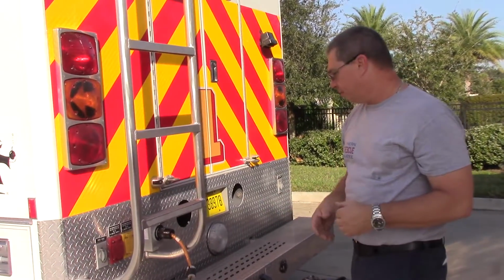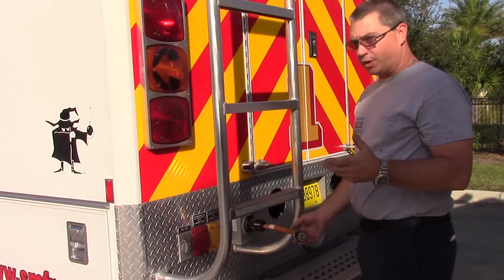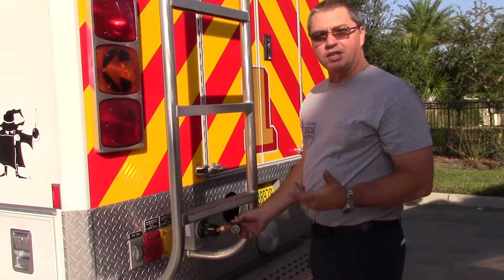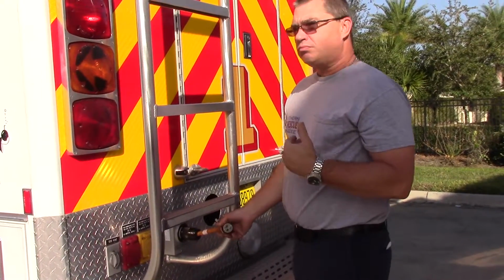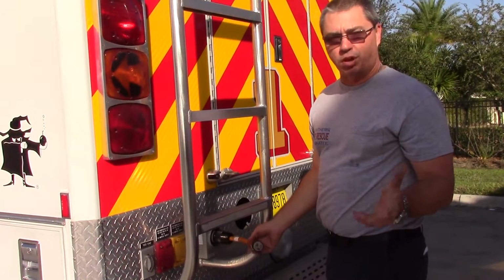Next step, we have a non-incident power up, say like open house in the station at the bay at station 1, is shore power. Shore power can either be done by the drop cord in the bay itself, that's been specially put in, it's a 30 amp cord, or if you need just basic lights, maybe an AC and you have an extension cord, you can plug this into the truck from shore power. Unlimited use and time, but you are limited to the power that you have that's in the wall of the receptacle that you're plugging into.